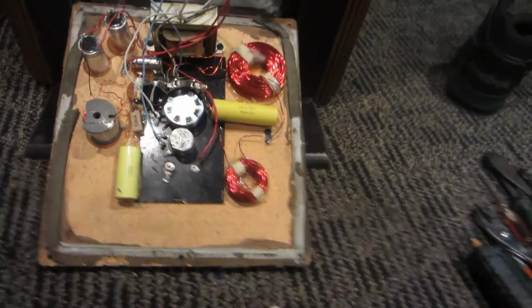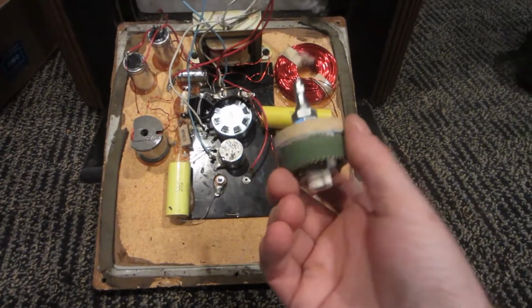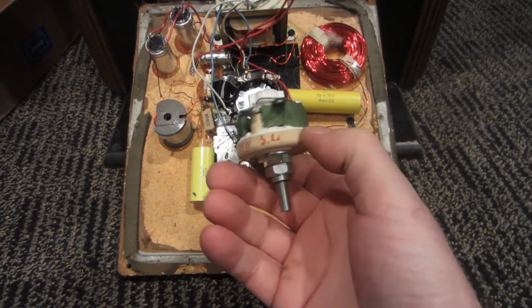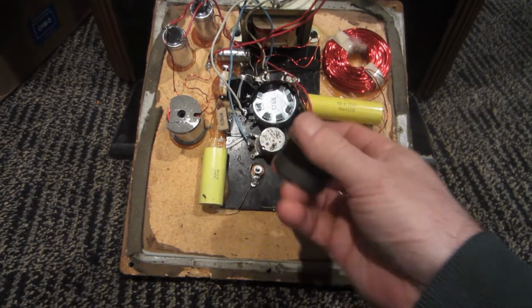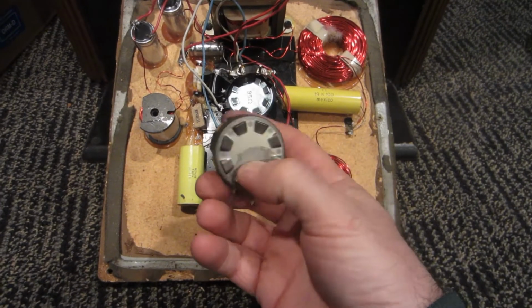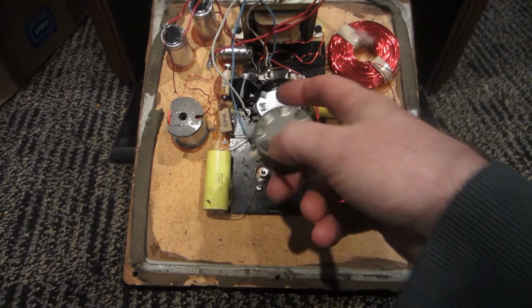Let's go to work. So here we are back inside once again of our RS3As, and I'm willing to eat crow where crow is on the plate. I went ahead and bought these rheostats. They were 5 ohm, 25 watts, so it wasn't an issue on the wattage. It was just the actual ohm loads that we wanted to match up with the originals, which actually this one's an original. And as you can see, it's identical, down to the last numbering. Even the numbering on the actual posts themselves, they're numbered 1, 2, and 3, and they're all numbered the same way on the new ones.